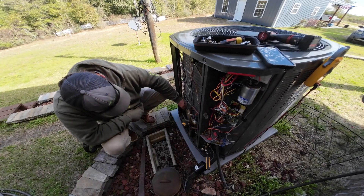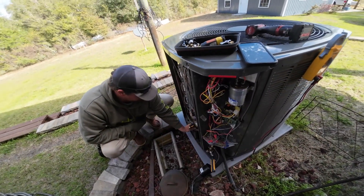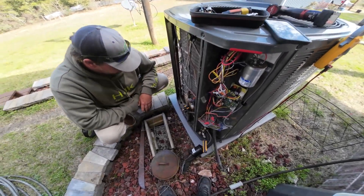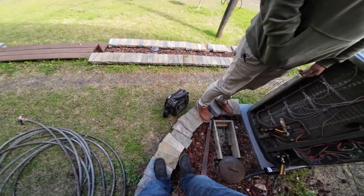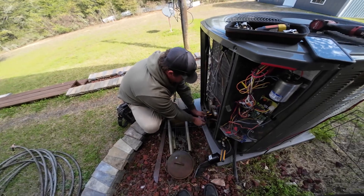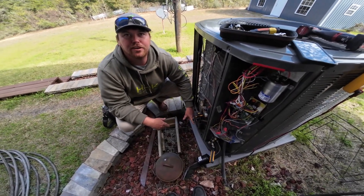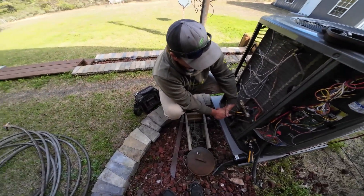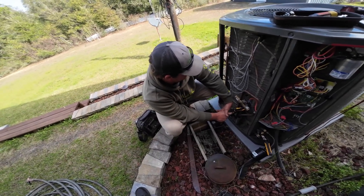It's going up now. We're thinking we need to change the sensors — look at it freezing up. It's slowly rising. That one needs to be colder, this one needs to be warmer. The true suction needs to be warmed up. I put it on my finger to cover it — it's opening faster now. Both still freezing up because it ain't open all the way — at 72, it'll eventually open all the way.